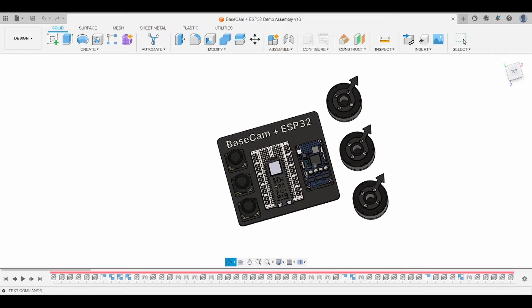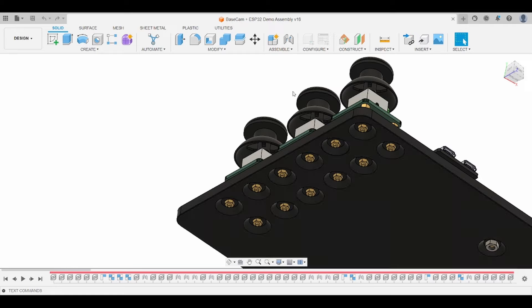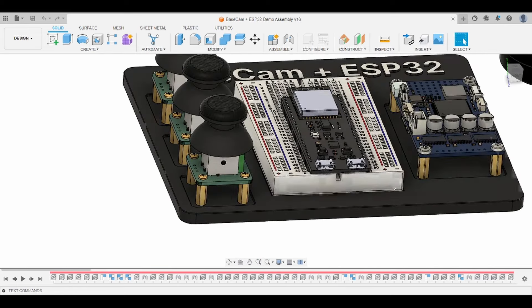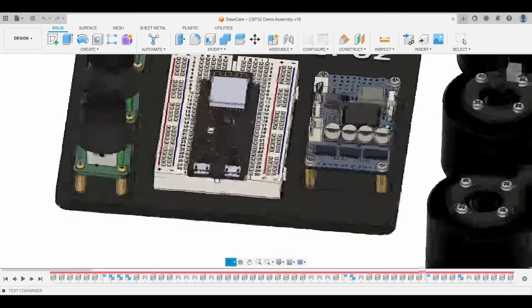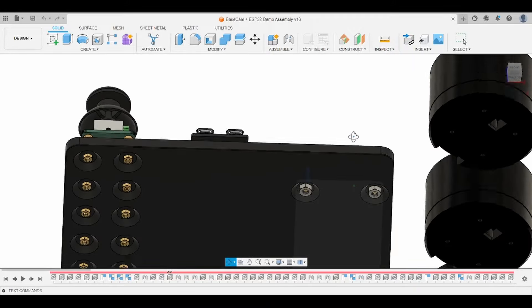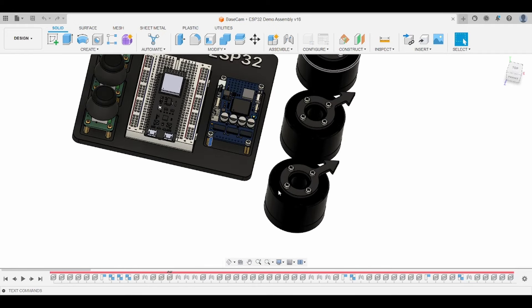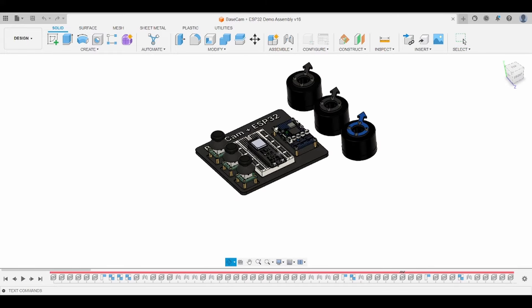This is the CAD assembly for the project. We have three single-axis joysticks bolted with M2 standoffs to the bottom of a 3D printed base, a small adhesive breadboard with an ESP32-S3 official dev board, M3 standoffs also bolted to the base holding the BaseCam Extended Long gimbal control board, and three DM5005 gimbal motors from SMC Powers with 3D printed arrows to indicate motor direction during the video.